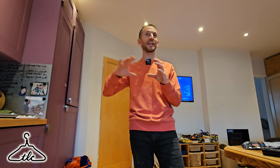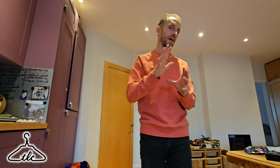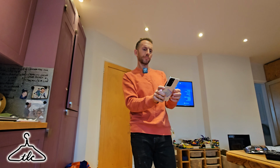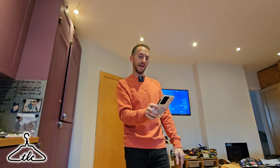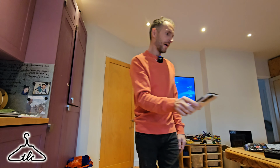Remember, it's a bit risky. If you know the wall's dot and dabbed and you're drilling through, maybe just feel and tap the wall. If it feels more solid than the other places, then you just need to make sure, or use a detector. I don't know if some kind of detector is going to show you where the glue is, maybe not. Yeah, you need about 10mm void for the wings to work, and I think that is it.